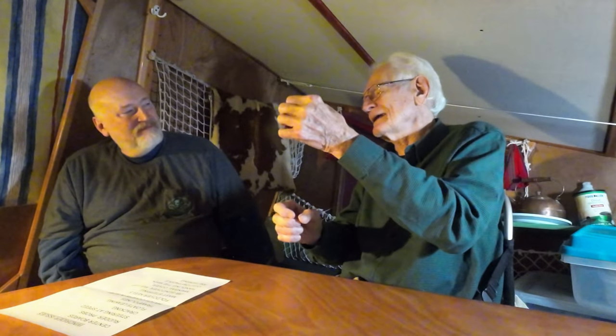If you put a little too much tape, you can always unwrap it one turn and cut it off and see if it fits. You want to leave a little bit of slop — be able to grab the rudder down below and feel a little bit of motion between the rudder and the boat, so there's a little room for corrosion before it locks in again. And don't put any grease in there. I'm not sure of this, but I think some of the rudder-freezing problems have been caused by putting grease on the rudder shaft, causing the plastic bushing to swell and break down. Even WD-40 is not good on plastic. That may actually be a bigger problem than corrosion.